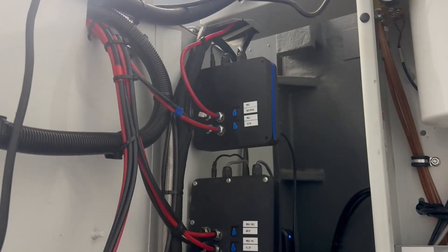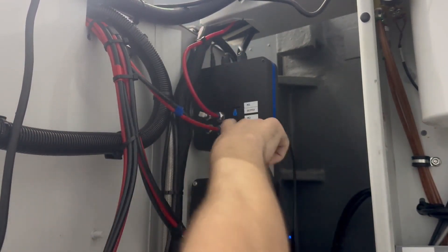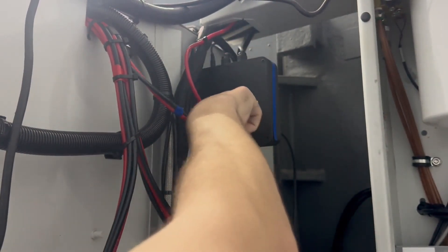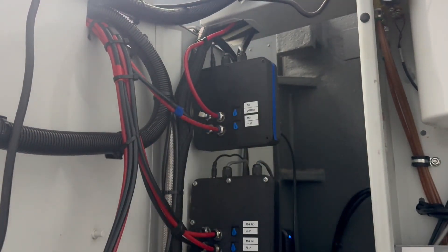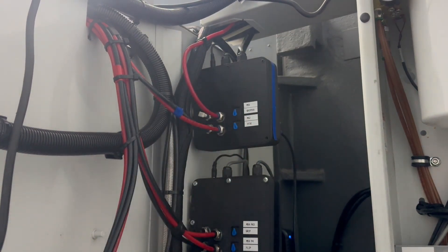If you are setting up with our instant solenoid kit, you're going to plumb into the 'flows energize' line — it's unlabeled on this prototype unit but it's the line on the right — and then plug off the line to the left, which is your 'flows normally.' When you get either the MCO signal from the machine or the override signal from the pendant, the solenoid will turn on, shifting air pressure from the normally-open port to the energized port, and because it's a 5-channel solenoid it will also vent properly.